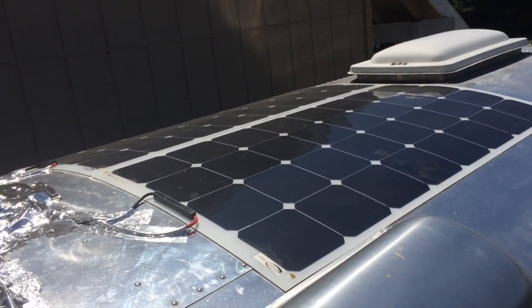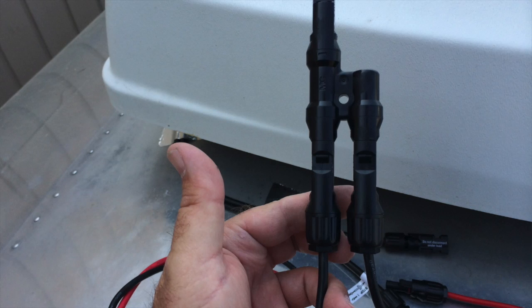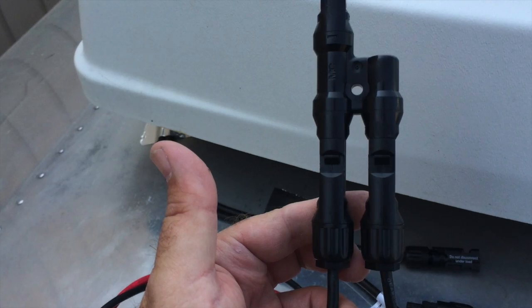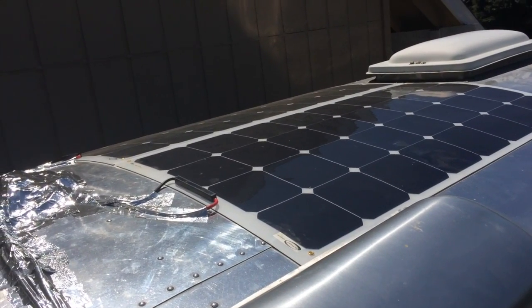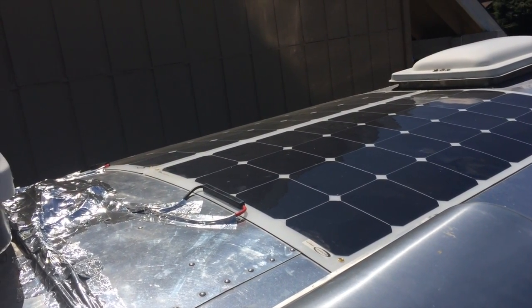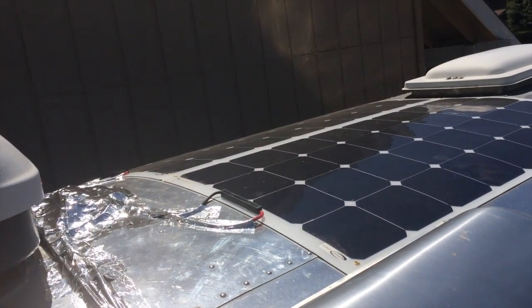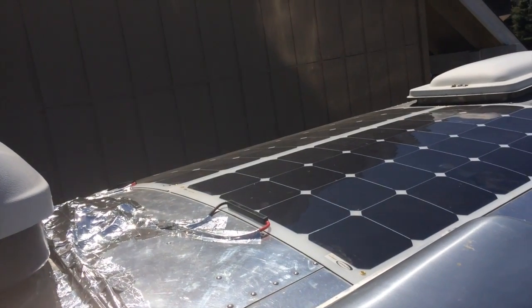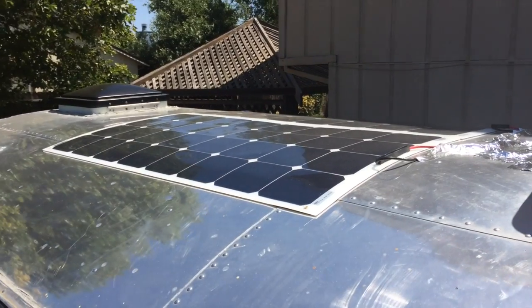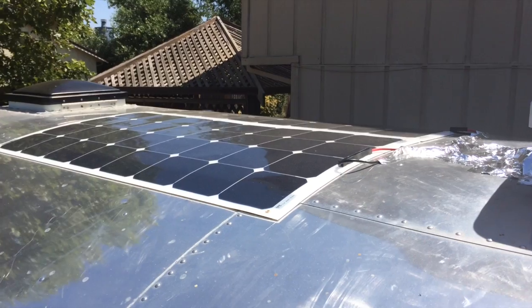The way it works is you can easily tie two panels together with a bridging connector that comes with the expansion kits. Normally you buy one kit that comes with a solar panel controller and a cable. When you want to expand beyond one panel — which is 100 watts — you get an expansion kit. The expansion kit comes with another panel and bridging clips that bridge the two panels electrically together. When you go beyond two panels, it gets a little more complicated — you have to build some kind of junction box, and I'll show you that in a minute.